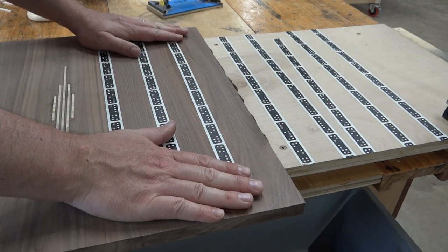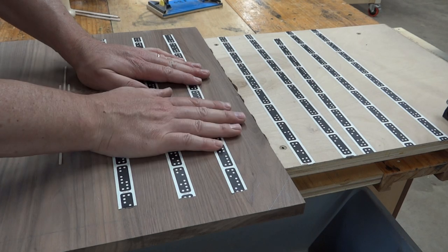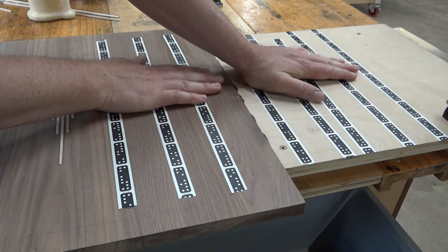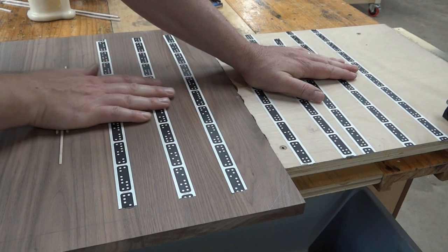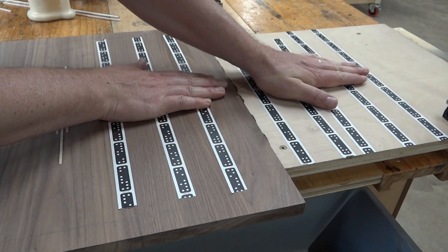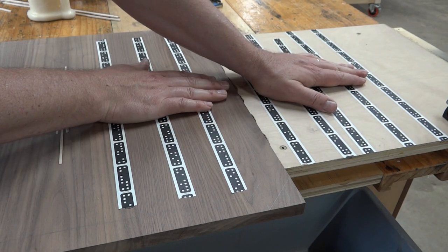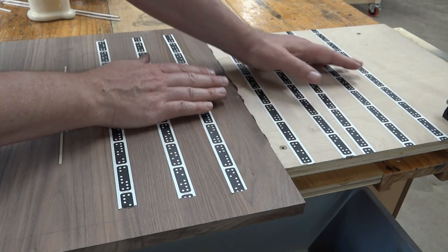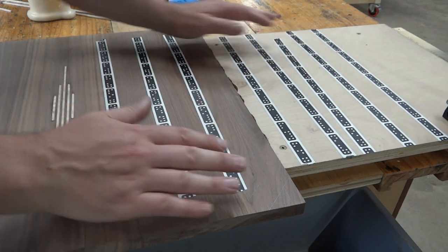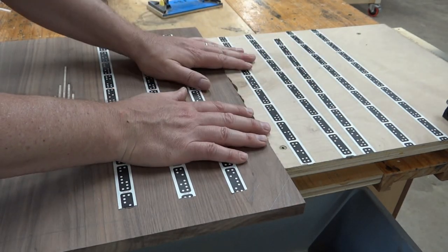And that is this: if I did not require tape on this piece to do the grid, this piece could potentially slide. Let's say my tape comes undone, this piece could slide and the shaper won't know it, and my piece will be messed up. Having tape here, number one, gives the shaper the opportunity to sense that the tape has shifted, and it'll warn you and it'll stop all the cutting. Having tape on this piece right here further lets me remove this, not the tape, but remove this piece, maybe put another piece up here, put new tape in, and add that to the scan.